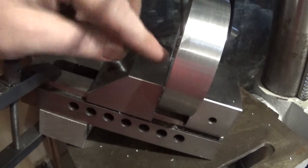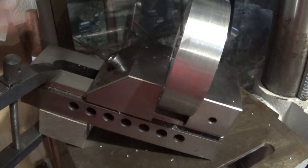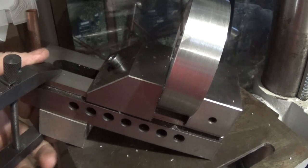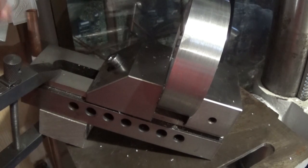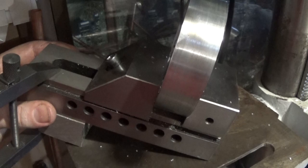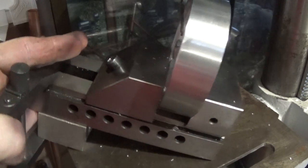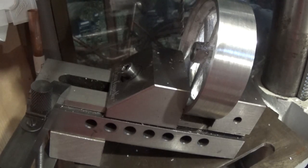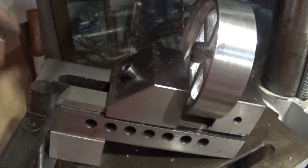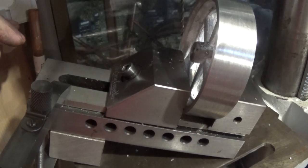So the last job is to drill a grub screw hole. I've just set this up in the vice and put a block under there at about the right angle — it doesn't matter very much as long as it's on top. Centre punched it, put the vice on this, put a clamp on so it doesn't slip. Simple as that — easy to tap and put a little 3mm grub screw in. And that's the flywheel pretty much finished. Thanks for watching guys, don't forget to like, subscribe, and be kind to each other — we'll do some more soon.